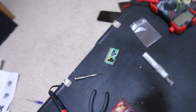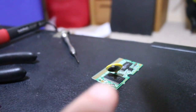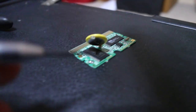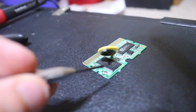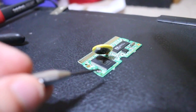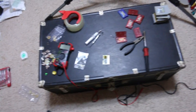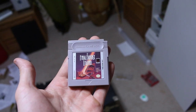That one I had issues with afterwards — it would not play at all. So I pulled up one tab of the battery and saw that I got a tiny micro drop of solder splashed on the RAM board. I could not get the game to play until I popped it off, cleaned off the splash solder, then tacked it back down. It took me longer than it should have because I was filming trying to make a video. If you haven't already, give this video a thumbs up for effort — it was a lot of filming.